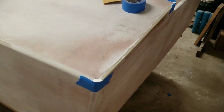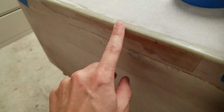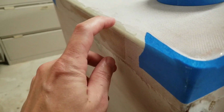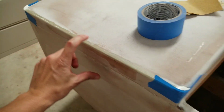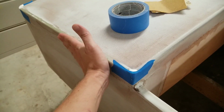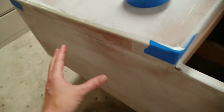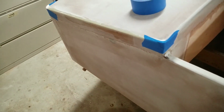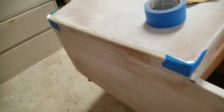Okay, fast forward, and I've gotten the edge of the transom sharpened off with fiberglass tows, like I said. The way I did that was I took a scrap of plywood with some packing tape, and I pressed that up against the transom, and I just used some props pushing off of my wall into the plywood, and that held it against the transom, so I didn't have to put any screws or anything on the transom. You could attach it with like hot melt glue or something too.